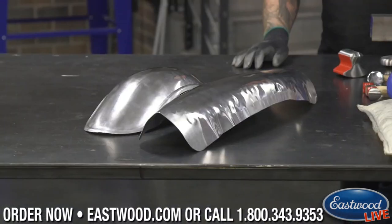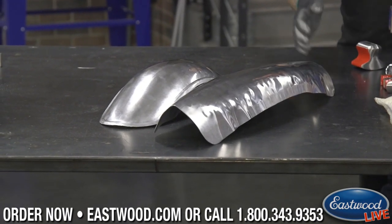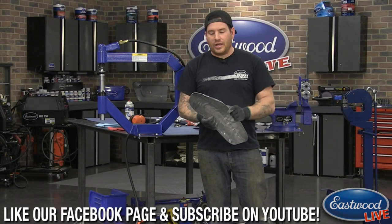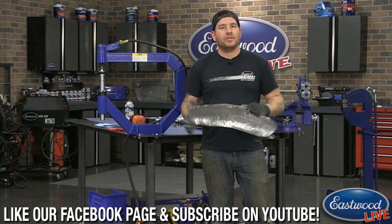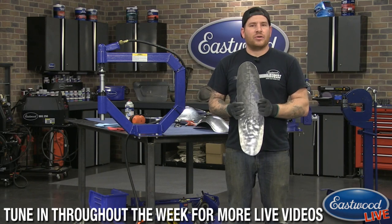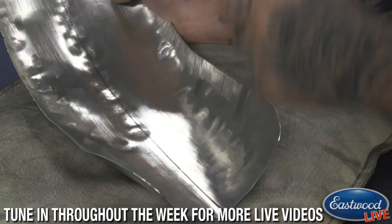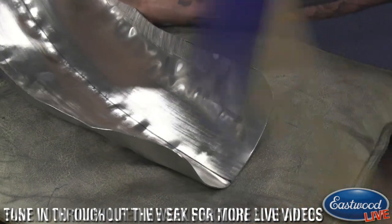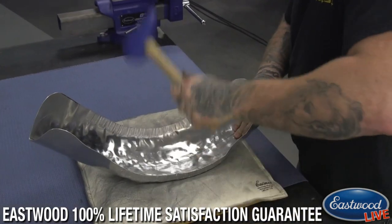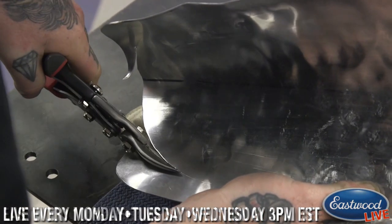So we were hammering out the heavy shrinks by hand, and I used the shrinker stretcher to pull in the other ones, and that's where it got us to a point where the piece was fairly flat, but it had the crown in it that we needed. And then after that, I had a little bit of work to do to get the panel to actually get the curve that we wanted. So I hammered it out a little more to put a little more crown into the piece. After we smoothed it, I could tell it needed a little more crown. So I worked it in there, which created a little bit more tucks.